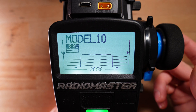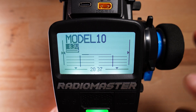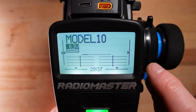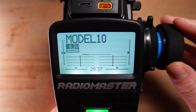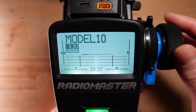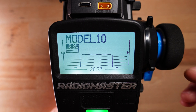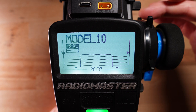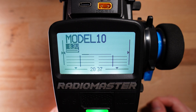If I bring the SA switch to the middle or inward position — a mode where the steering wheel controls both steering channels — then if I use the T1 trim switch, you will see I trim both channels the same way with the same value. This could be fine for you, but usually you want to decouple the two channels for trimming. So you can control trimming for channel 1 with T1, and the trim for the second steering channel with T3 — the trim switch on the front of the steering mount.